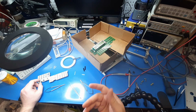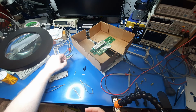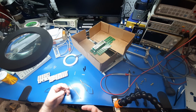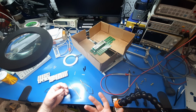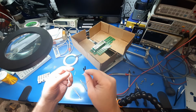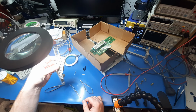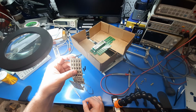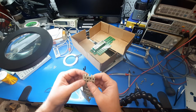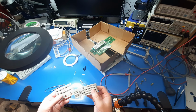Now, if you have just some remote and it would be $20 to buy a universal remote, you don't necessarily need to go the expensive route of using materials like this. You can, if it's easy to take apart, you can absolutely go that route of graphite. Get a little graphite, sweep it onto each of those contacts, and you're good. The method of gluing aluminum is also potentially viable. I would use it on a junk remote first, just to see how well it adheres to the material. But yeah, that would probably work, and I've read of other users on forums describing that worked well.